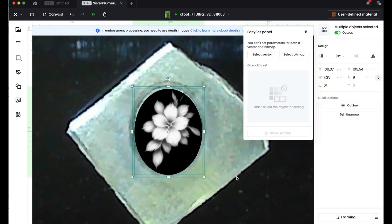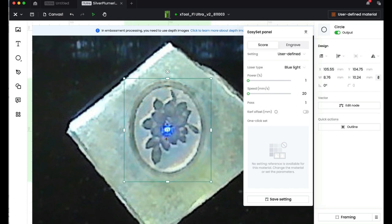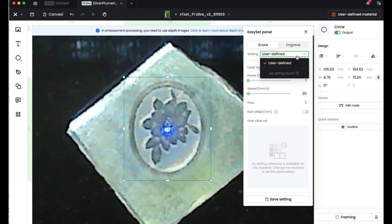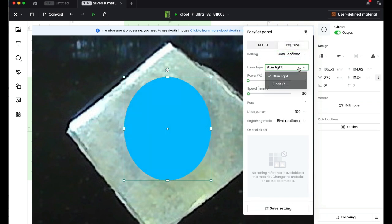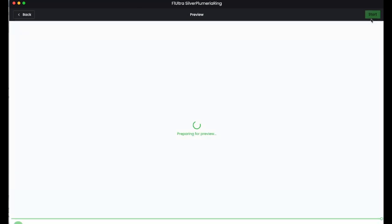What I want to do is give this a quick cleaning pass. I'm going to delete that image and put an oval over the top of that. I'm going to engrave with the IR at about 50% power and 10,000 millimeters per second at a high resolution. I'd like to take the frequency to about 40, just to make it a little less aggressive. We'll go ahead and process that and do a quick cleaning.